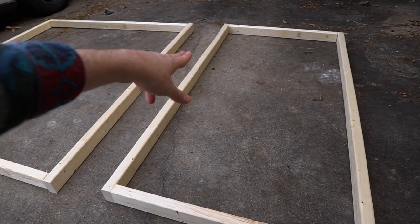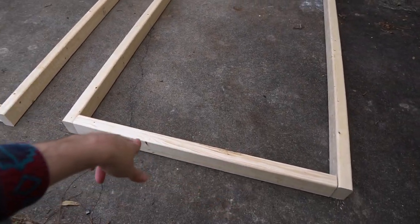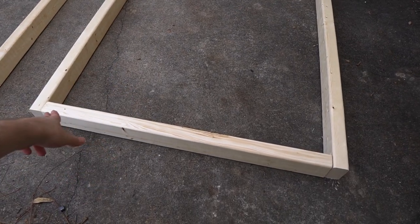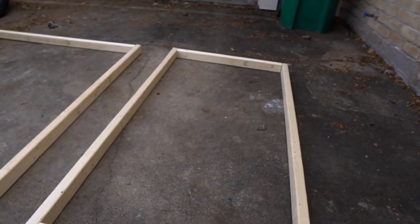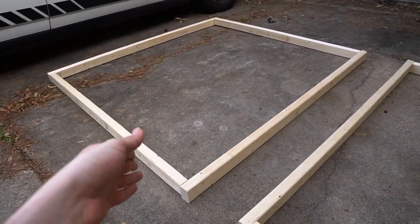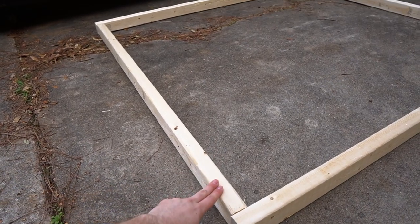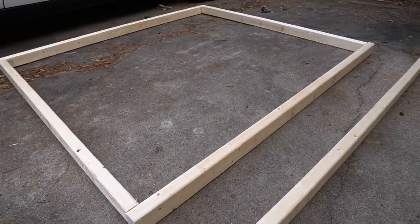All right, so everything is pretty much set up. I guess I'll tell you guys the measurements that I went ahead with for this particular design. So the entire width of the bed is gonna be 62.5 inches, and the height of the baseboard is 32 inches total, 29 inches on these 2x3s that I cut, and the headboard total is 56 inches, and so these bad boys are 53, and again, 62.5 inches